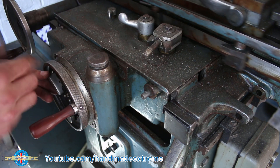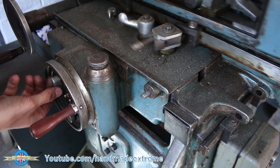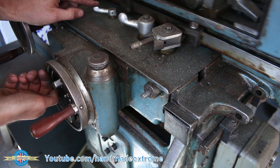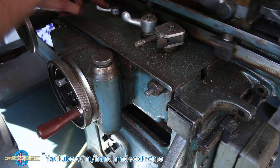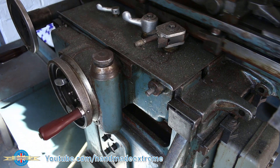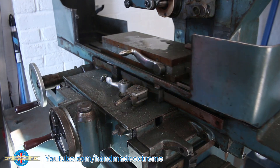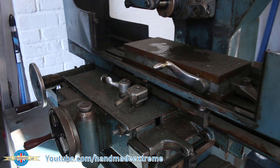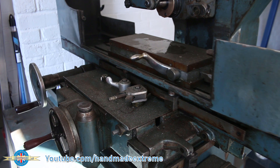Let's see if we can get the movement going that way. I'm pretty sure that makes it go that way and that makes it go that way. Here we go — this engages that axis. If I do that, stops it. I can change direction now — re-engage — come back the other way. Brilliant, it's working! I've just had a quick look at the rotary converter and that's only pulling 1.2 amps per phase and 5.6 amps off the single-phase supply — fantastic, really light load. Really happy.